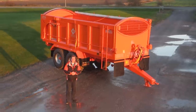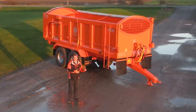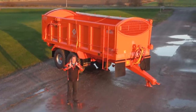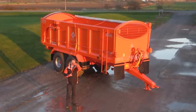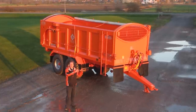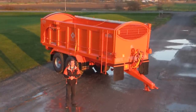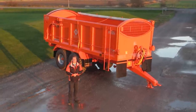The highest of arches is the 450mm arch, and we do that for people specifically who are loading potatoes into the trailer. Because you compile potatoes really high, you want the rollover sheet to go over that crop and not try and force its way through the crop. So our high arch is designed for the potato growers who like to get that really good load on, but we don't want to get the crop wet.